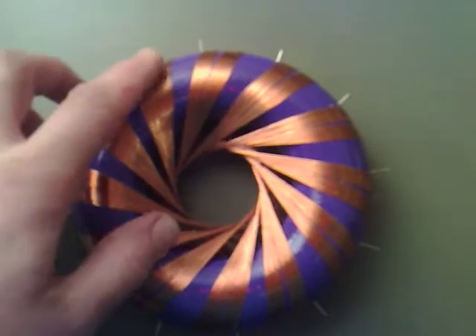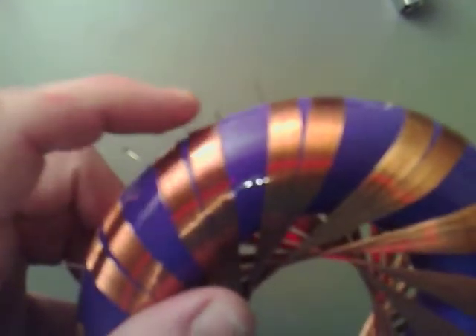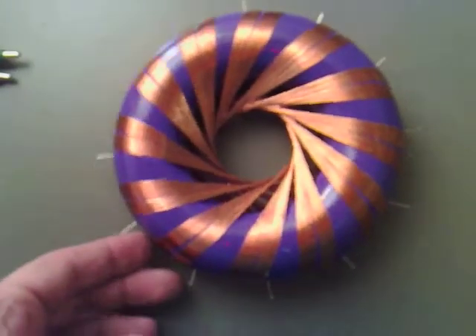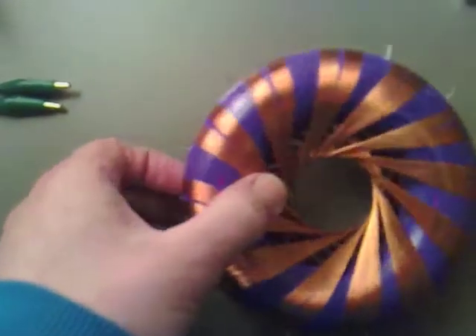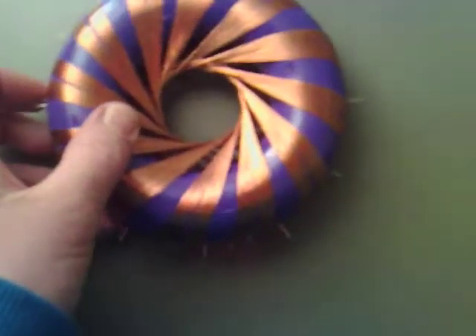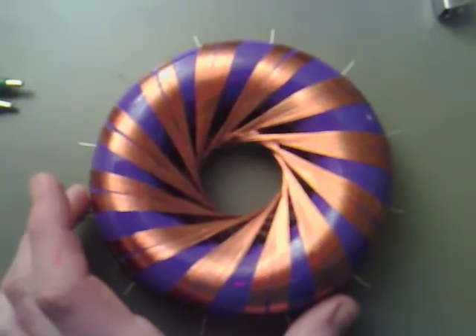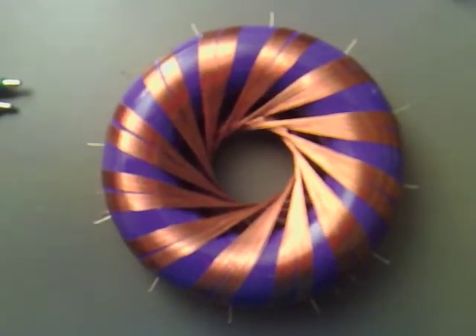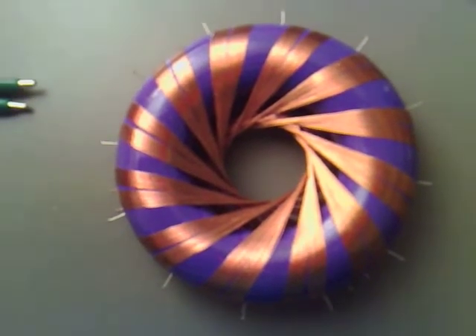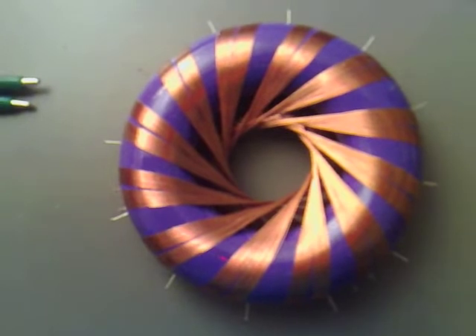What I've done is I've left the one pins in, which are every 30 degrees. I've left two lugs in, which are the actual connections to that winding. I've left them in here and here, and then the final one is going to get left in over here, which is going to make it 120 degrees out of phase for each one — a three-phase system.